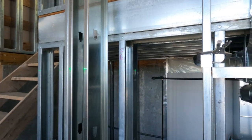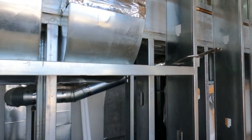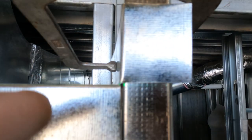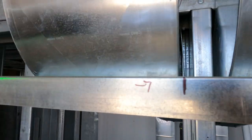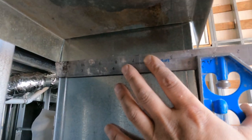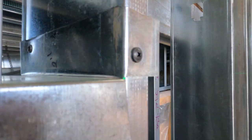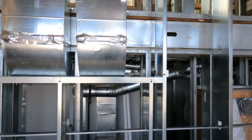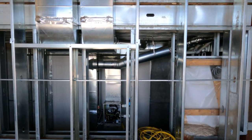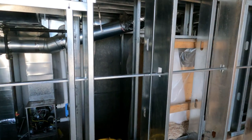Using my line laser, I check where the line's going to hit the duct on the back side, then laser it out and set my headers to that. Simple as that. You just measure in from the stud to the first center, square everything — always square everything. Get your two screws in the header. Screw in the front, crimp the back. Channels are all in — it's beautiful.